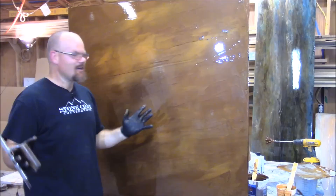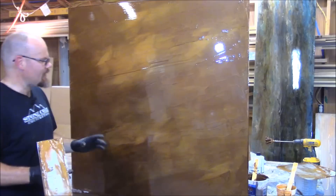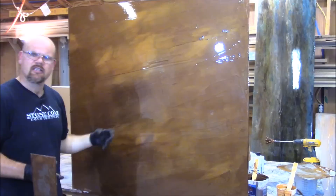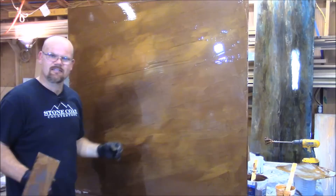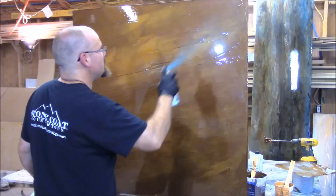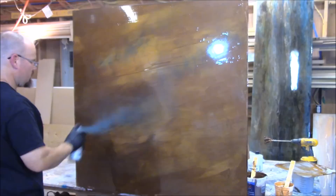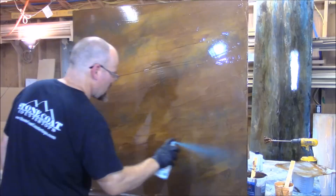What we're going to do now is spray metallics into the wall. You've got to understand that when you're doing a vertical piece, it's not the same as doing a counter. You're not going to get the vein effects or some of those effects we achieve on a flat horizontal level plane, because this isn't in liquid form where it's going to meld and move. It's stuck vertical, which is really cool, but you get different effects. If you're trying to put veins in it, you still want to build shower walls flat. Here's some lagoon — I'm just going to fog a little bit of that on here, fogging it from a distance rather than up close. That looks cool.